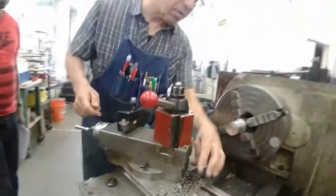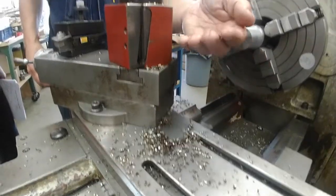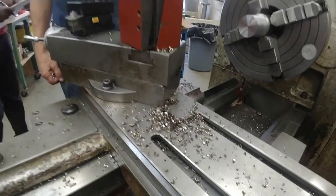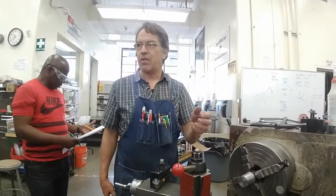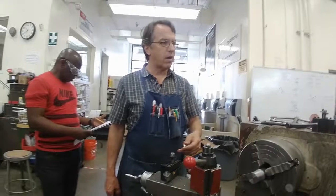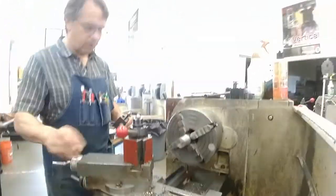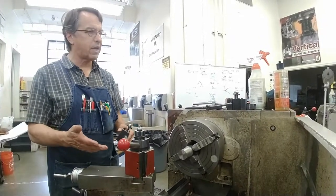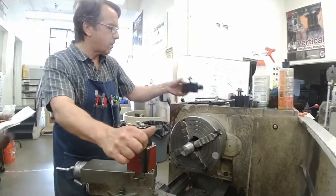Notice the color of the chips. Now you're getting chips that have changed color. They're heating up hot enough to turn golden or brown or deep blue or purple or even sky blue. Golden is about 600 degrees. Sky blue on the other end is about 950 degrees. But that's normal with cutting steel with carbide. Okay? You don't need coolant. And on the free machining steel that used on the bushings, you didn't usually get much coloration because it doesn't heat up enough. Okay, so we just did our whole first end,